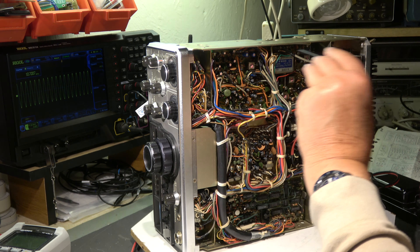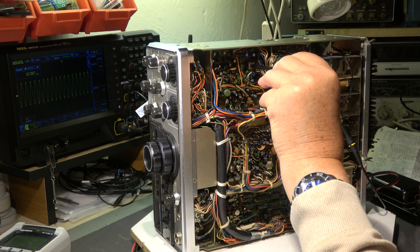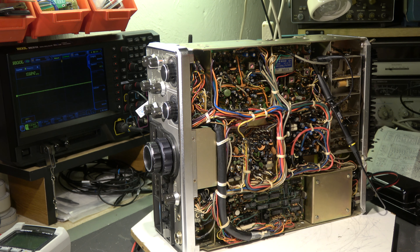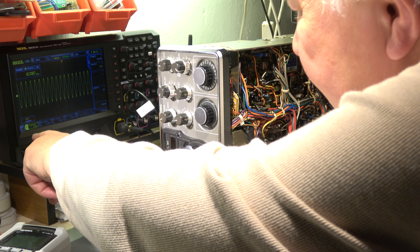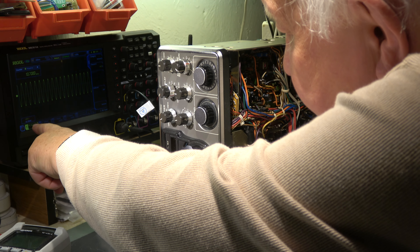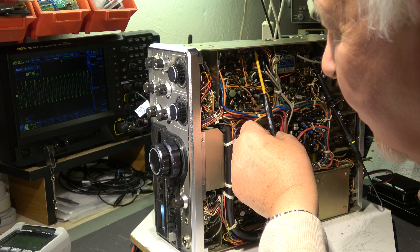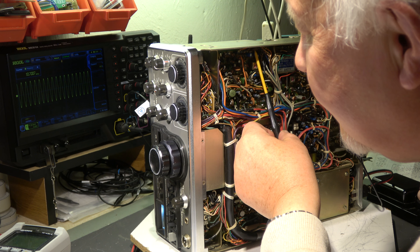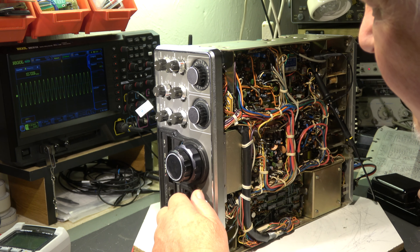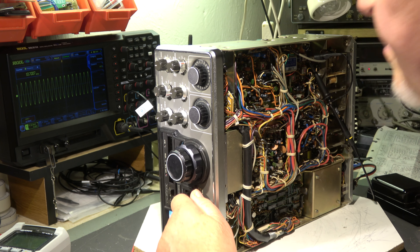These are both this filter and this one — these two filters. I did it and we can see it is already maximum. This one also was maximum, there was no tampering with it. I can measure 246 millivolt; it should be the same as we have in FM which is 223, so the CW value has to be reduced a little bit. There is a trim pot, and I will reduce it. Now 223 in CW — okay, 228, 238 — okay, that's approximately the same.